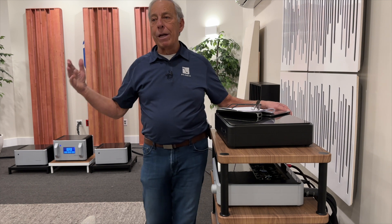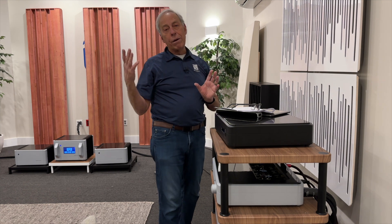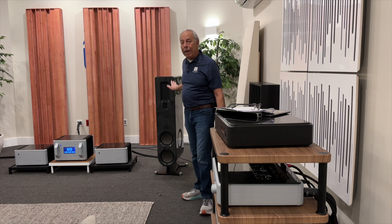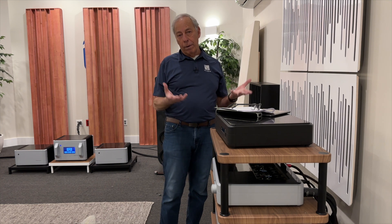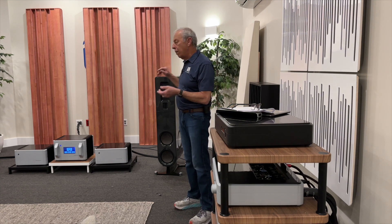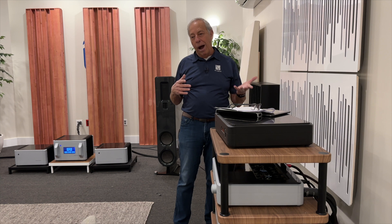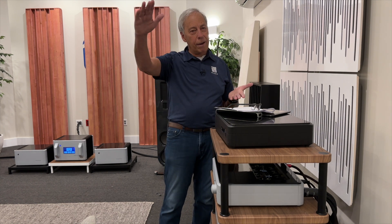When it comes to matching the output of a power amplifier to a speaker, we've got to take everything down many magnitudes. A speaker like the FR-20s here has a 4-ohm input impedance, and they want to be driven by something very, very low — way below an ohm. Our power amplifiers' output impedance is in the milli-ohms, a fraction of an ohm. There are variations on this, like a vacuum tube amplifier with an output transformer having a higher impedance than a solid-state amplifier — nonetheless, the ratios still apply. Low to high, and you're cool.